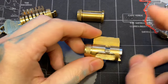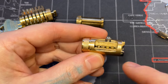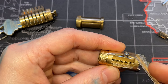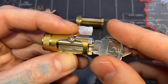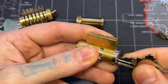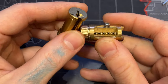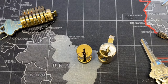One last thing to note: notice how I left some brass on the end right here at the front. You don't want that too thin because the body can start to warp. It's super important to have brass at the end so that when you put your key in, it holds the tip of the key — that way your key doesn't jiggle back and forth. Otherwise the key will quite literally just fall straight out of the plug. Anyway, this was a new cutaway I just discovered. It's super easy to do on SC1 keyways and really useful to show the binding principle. Thanks for watching.